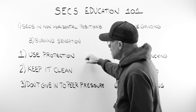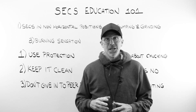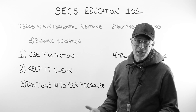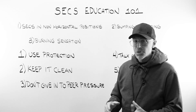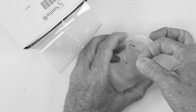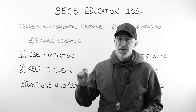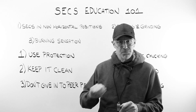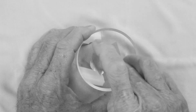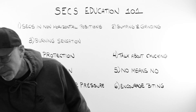How do we overcome those issues? Number one: use protection. Your greatest weapon against slippage is the non-slip intermediate film, or anti-slip intermediate film — sold by a brand name starting with a big R, but I'd rather not get into trademark issues. Treat those things very gently; they're very expensive, so only use them when appropriate. I've found if I can't get one down flat, it's better to let the edger pressure smooth out a small wrinkle than keep reapplying. For the back side of a lens, I use surface tape — I've always had excellent luck with this, and it can save you a lot of money.